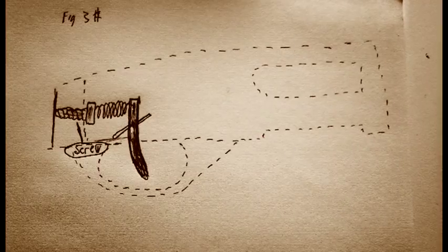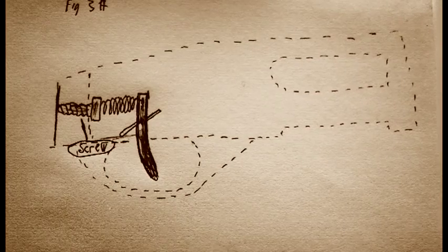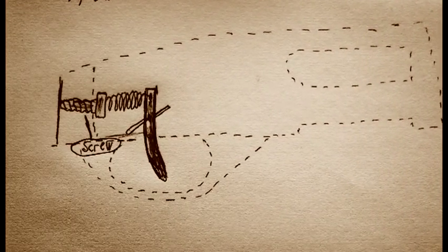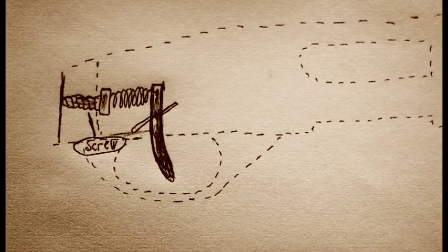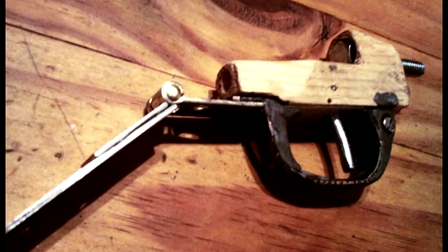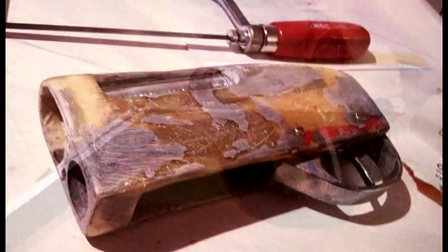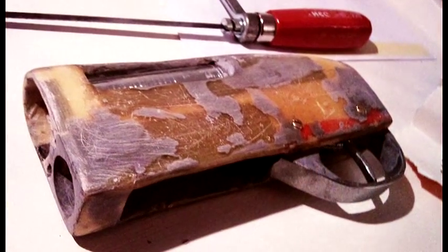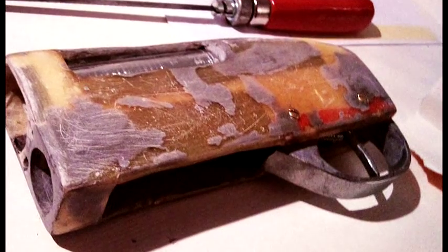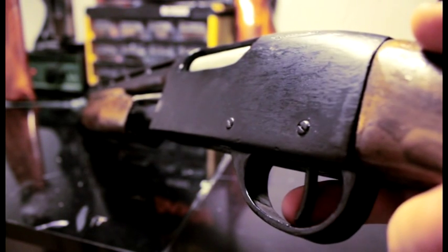The pin also needs to go through the slot inside the receiver where the trigger is attached. Now if you look at the drawing, you'll see that the spring is attached to the wood inside the receiver with a small screw. Once both the pivot pin and the spring are attached, you'll have a working trigger. And in this cutaway, you can see how it should look when the trigger and trigger guard are in place. And finally, with the receiver fitted outside, you can also see that I made a guide hole for the magazine tube in the front of the receiver — that's for additional support. If you follow these instructions, you'll have a working trigger.